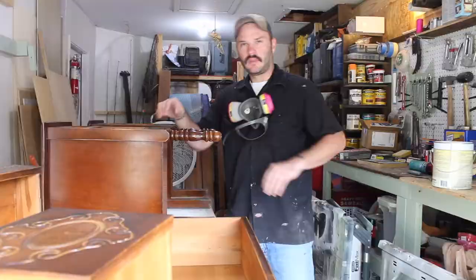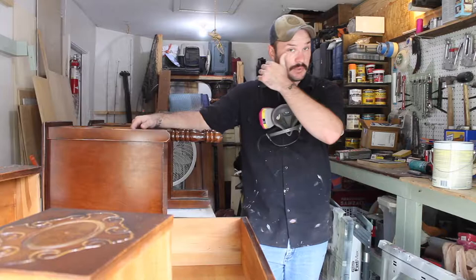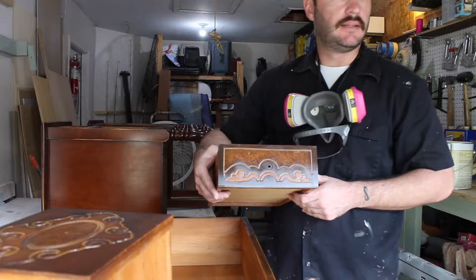What's going on guys? It's kind of an early morning. I wanted to get a jump on this vanity. I just got done shellacking it. I don't know if you can tell but it's got a pretty good sheen on it, which is great. That'll lock in all those odors and stains and whatnot, and I'll be able to paint right over that. I sanded it beforehand so it's got a real smooth finish, so there shouldn't be any big defects once we end up painting everything.